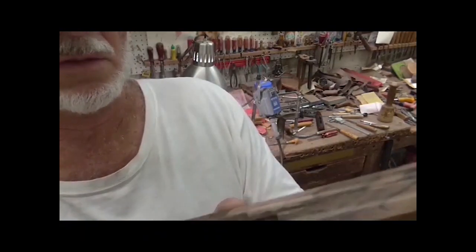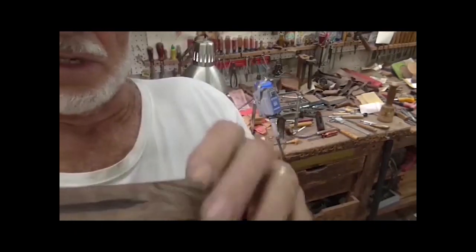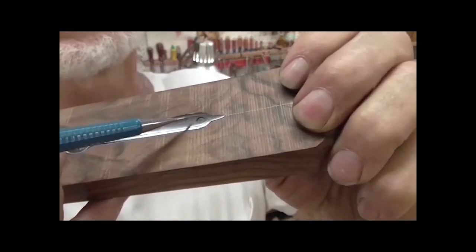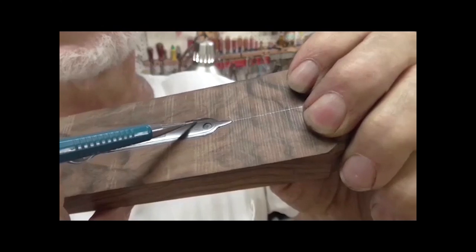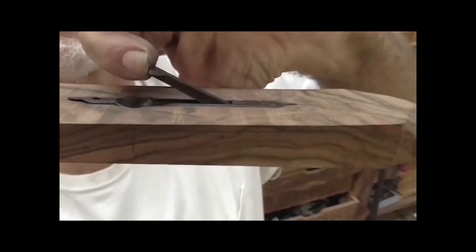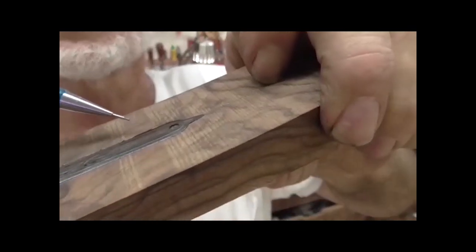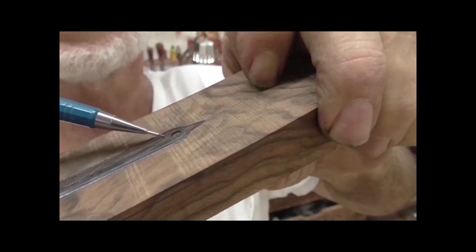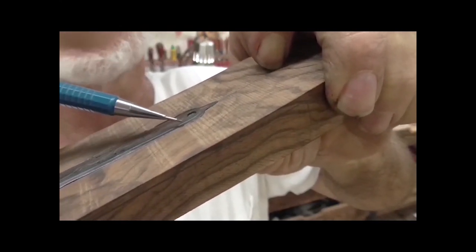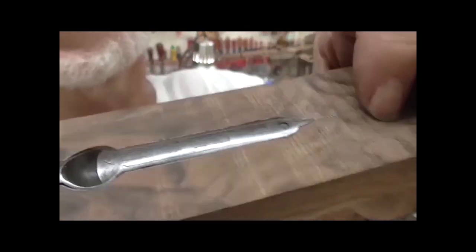this joint right here. The length of this screw and the positioning of this screw is coming out right here on top, and it's a little tiny bit recessed to this piece, this escutcheon, this release lever. That's what turns the forearm loose. When you pull that up, that lets the forearm come loose. But this screw is not quite up to this surface, and that's how much further down this escutcheon has got to go down into the wood. It's just literally thousandths. It's about 25 or 30 thousandths.